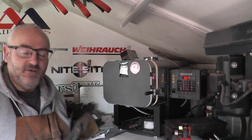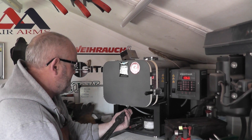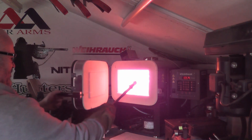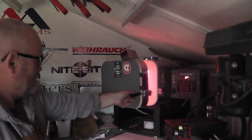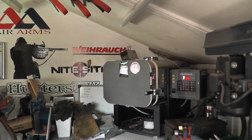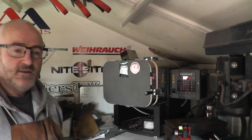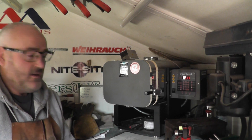We're at 1060 now, so I'm going to put this in. It dropped to 1046 — now we should go back up to 1060. We'll hold for 10 minutes, and I'll update when we quench.